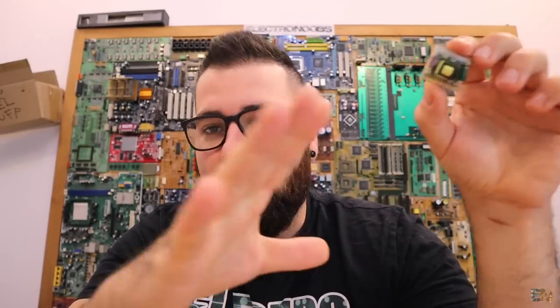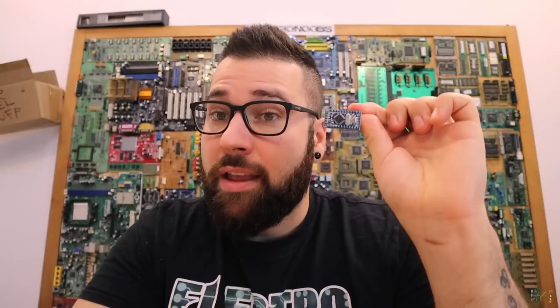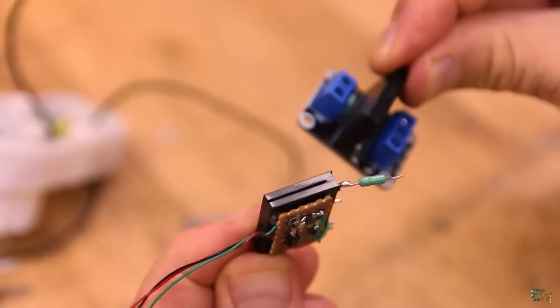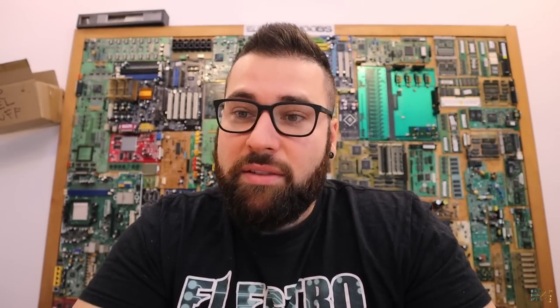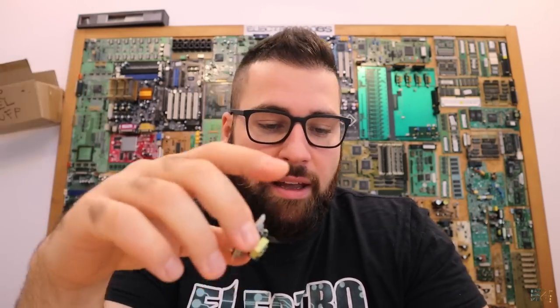The Arduino uses lower voltage, so I selected a very small voltage regulator using a small transformer that can deliver up to 500 milliamps — more than enough. With this being so small I can fit it inside the case and supply 12 volts to the Arduino, which then regulates down to 5 volts for the radio receiver and the relay. I'll also show how to take the SSR off its PCB and solder the transistor and resistors onto a smaller PCB so everything fits inside the case.